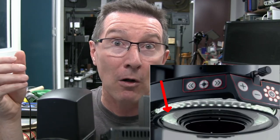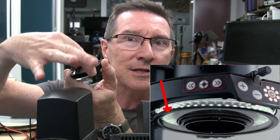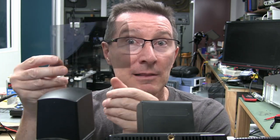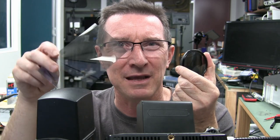I've actually added some polarizing film onto this light, polarizing the light to specifically duplicate the effect Andrew is seeing with his really expensive high-end Leica microscope. It's similar to the Mantis, which has the option to buy a polarized light that you can rotate to change the polarization angle. This one I'm using is a circular polarizer - the most common for cameras. Circular polarizers work much better than just polarizing film - horizontal or vertical linear polarization. I got this film from an LCD monitor teardown - you can actually just peel it off the front and back of an LCD.